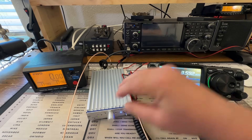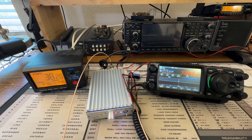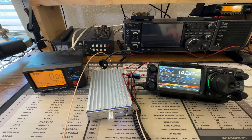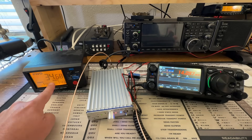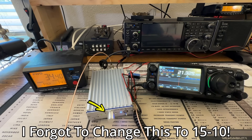Hot dog! Let's go to 40. Never mind my high noise floor — 5 watts going in, 38 watts going out. Let's just do 20. CW — 35 watts. Hot dog, I love it! Now let's just do one more just to illustrate the point. 15 meters — 35 watts with 5 watts in.